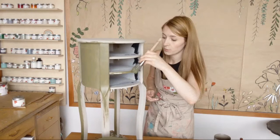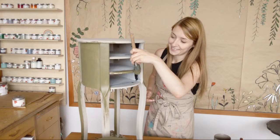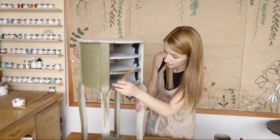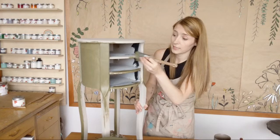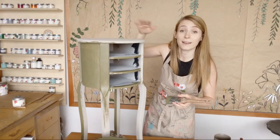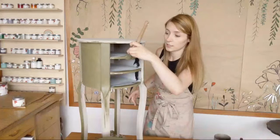If you paint like that, it kind of just collects up there — don't let it dry. Just a really quick pass, smooth it out. If there's any extra texture, just go ahead and sand that with the 220 grit. And it does make the paint feel a little smoother too, if you're using a fine grit over flat surfaces like the top. Right now it feels very chalky and very matte, but 220 grit will really make that very soft — kind of like you waxed it, but you didn't.